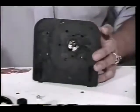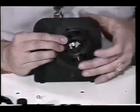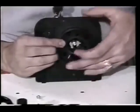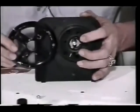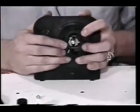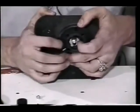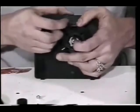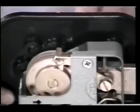An even better one comes with our little opening kit. This is a drill guide. The guide fits on the lock and screws into the two holes that actually held the dial ring on the lock. At this point, one simply takes a hardened drill bit, drills into the hole required, being careful not to drill too far, and using this as a drill guide. This supports the bit. At this stage, we turn the dial several times to clear the pack. Then we insert the probe that comes with the kit.